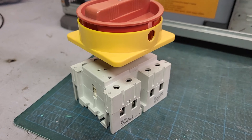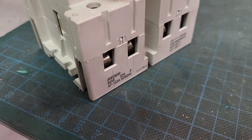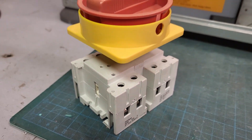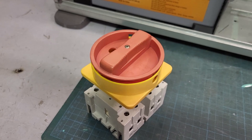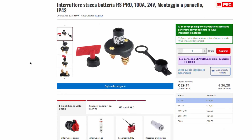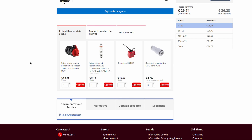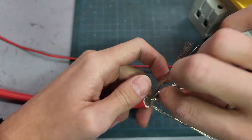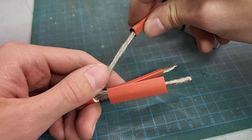I added the power switch — in my case a recycled multiple disconnector switch rated for 63A. By wiring all the contacts in parallel, the current capacity increases, making it capable of handling 100A. I suggest you get a switch with a higher current rating. I'll include product links in the description. I prepare the cables precisely to distribute the current evenly across the contacts.